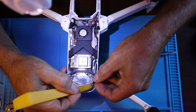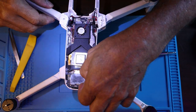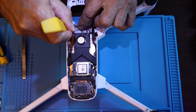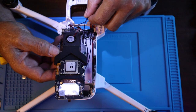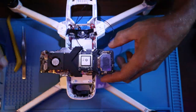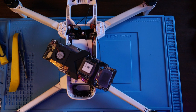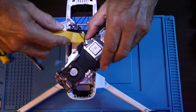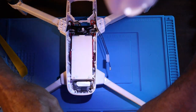Removing the connector here — it actually has silicone on it, but it came off fairly easy. There's that last screw I forgot to take out, so now the board is coming out. On the top there's that mylar ribbon cable again — you need to release it. Pull it up first on the side that doesn't have the SD card reader on it. Now it's time to get the antennas off, and I've got to remember to mark which one belongs where. I put a piece of tape on one and I knew it was going to be the one farthest away from the front.